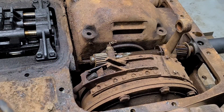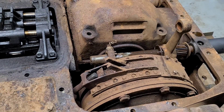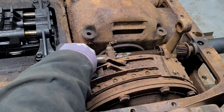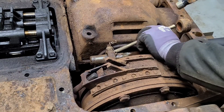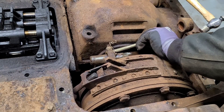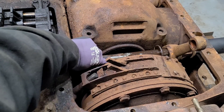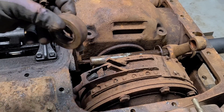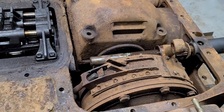We're out far enough to have this arm out, so we will lay these in order — they go back in the way that they came out. See if that needle bearing — yep, keep that with that same arm. And now I'll try and drive that brass oiler off of there. I saved you guys watching me tap this all the way down to the end of the shaft for the last five minutes, but there it is. And last but not least, we need to keep pulling this shaft out. We are very close.